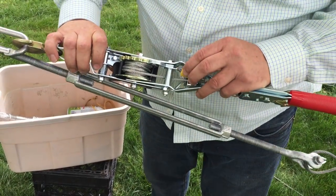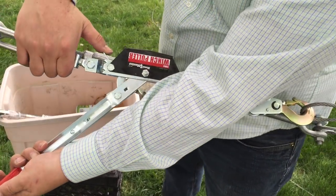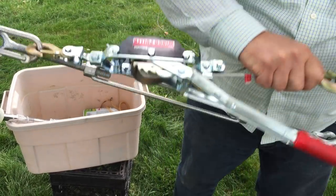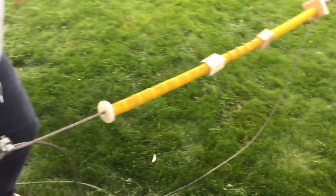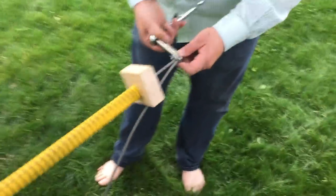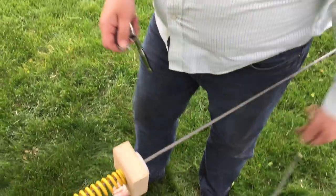Click this off. It's now engaged — bring it up, re-engage it. Now I use this to tighten it a little bit to release the pressure back here, and now it can go back one. It's a process of doing that. We may have enough now that we don't need to do that anymore. Just use the carabiner here because it's easier than hooking into the strap — it's not life safety. Now I've got to disconnect my extra winching strap. You see you lose a little bit because your live line laid slack a little bit as you're doing it. But again, you have the turnbuckle to do that. It gets you a lot closer to the tension that you need.